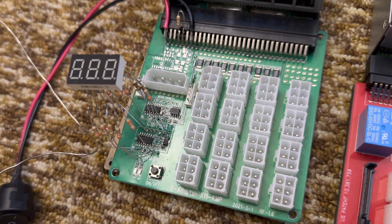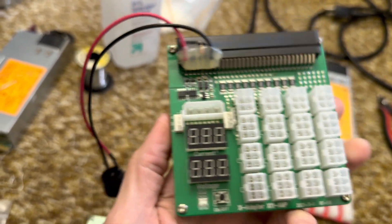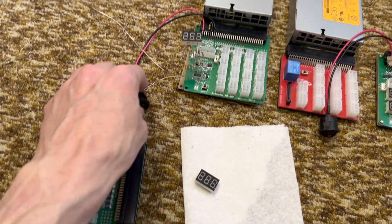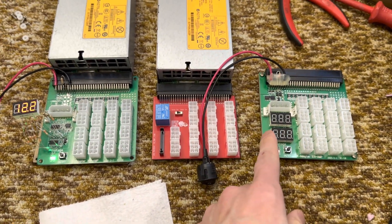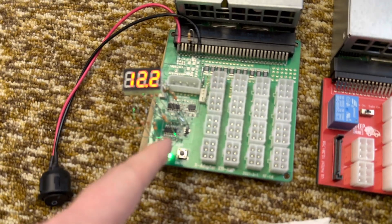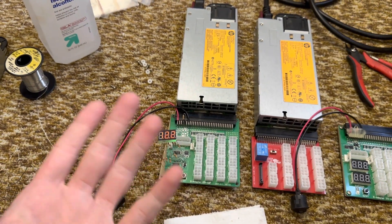So I don't know — maybe you guys have some tips or tricks. I don't see any other way than de-soldering these and doing a lot of fiddly work with tiny surface mount resistors, which is doable, but I wonder if it's worth it for the 5 watts or so you could save on each of these. You could easily save 5 watts and still have the voltmeters working, which I think is kind of cool. Let me know what you think — whether or not it's worth it. I think it's a little ridiculous that these take 5 or 6 watts for blindingly bright screens when you could get most of the value and save the power if they'd just put resistors on the board — that would have added a few cents. But I get it, it looks cooler and people don't care. What do you think?